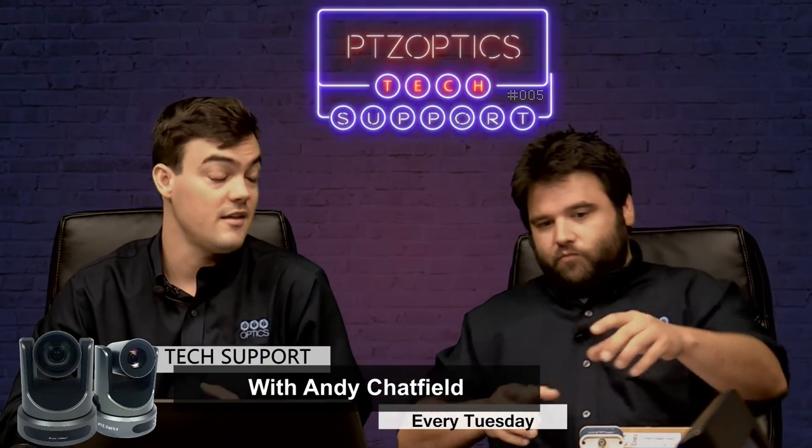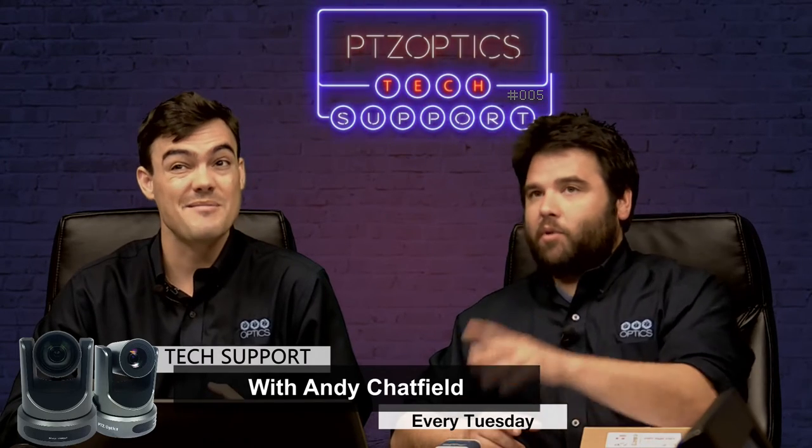The other thing I wanted to mention: I already talked about going over fiber using the iKron 3022. The other thing you can do is use a frame grabber. This is just a cheap little Epiphan one; there are some others made by Magewell that we use regularly. Basically, you can pull in one SDI feed and it goes out to one USB. So essentially, you can run your long distance using an SDI cable, and then convert it to USB 3 at either end. This is not the most cost-effective solution, because these devices cost between $300 and $400 a piece, and you also have to pay for all the SDI cable. It works very reliably — probably the most reliable way.